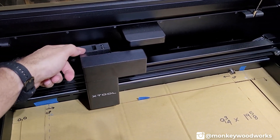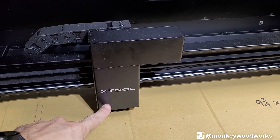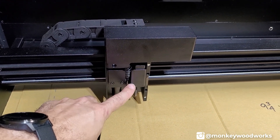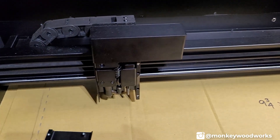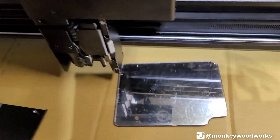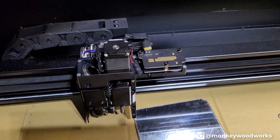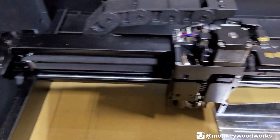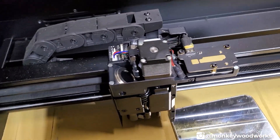Here's the laser head — let me move it out so you can get a better shot. The laser head has air assist, and the laser itself comes out of one side. The cover is held on by magnets, so it's easy to remove. Right here is the actual laser, and this is the drive that allows it to move up and down. Up on the top right is the close-up camera, with a light ring around it. Inside, you can see there's a mirror for laser alignment — the laser comes across, hits this mirror, travels across, hits another mirror, and goes down. That's how the beam path works.